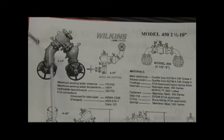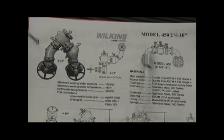But you'll notice with this small pipe bend here and this fitting here that it gives you that up and down piping configuration of a double check. The 2.5 through 3 inch, they do not have the same construction. They take a standard 350 and just put elbows on the downside to give it that up and down orientation.